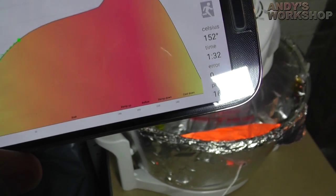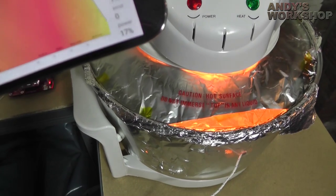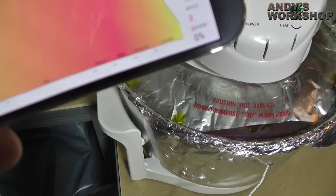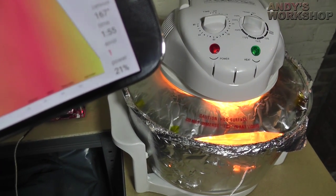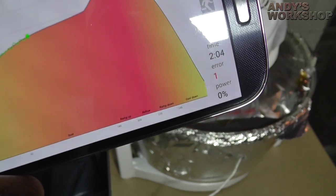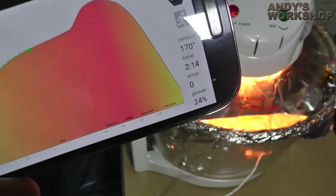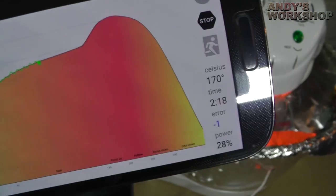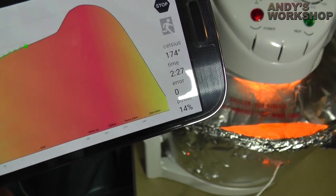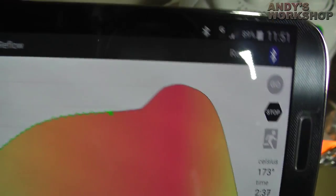During my testing I tested each of these modifications separately. The insulation came last, and it was the insulation on the lid that made a huge difference. It's a 1.2 kilowatt halogen lamp in a 12 litre oven — you can get these ovens on eBay for about 25 quid. Another significant change I made was to change the linearity of the output percentage. Since the sine wave of the mains supply doesn't have as much power at the start and end as it does in the middle, I applied an integration formula to make the power response non-linear throughout the curve. You can read about the formula on the blog. All these improvements together have made a really significant improvement to the way it tracks, and it's tracking really, really accurately.